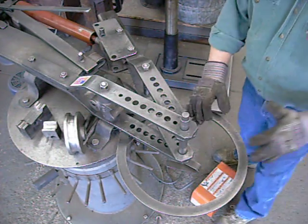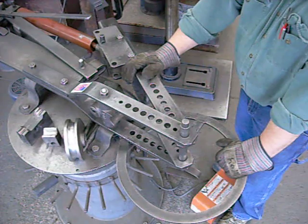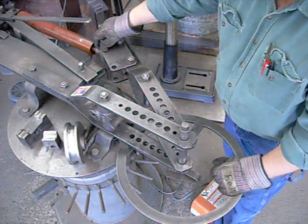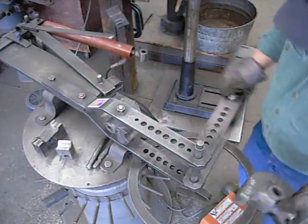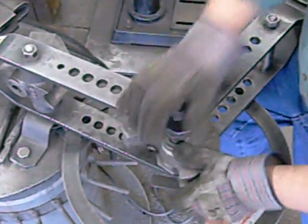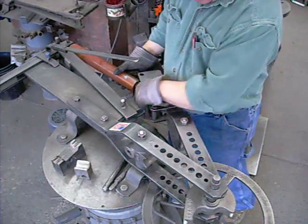We're going to make a 1 inch OD tubing bend on a 1 inch OD x 3 tube die. First, you have to insert the form die in the bender. We're going to pull the hydraulic pin and set the form die between the frames on the 20B — the center frame slides right in. We're going to be doing the bend hydraulically, so we'll re-pin the hydraulic cylinder right away.